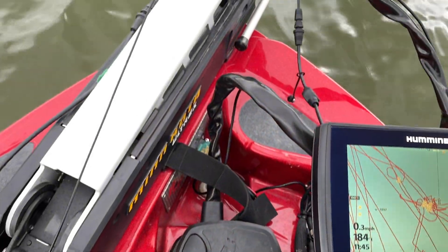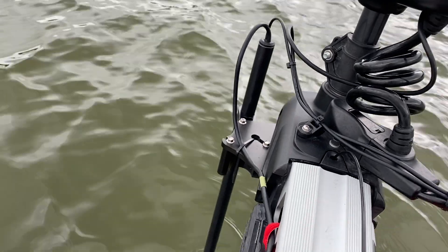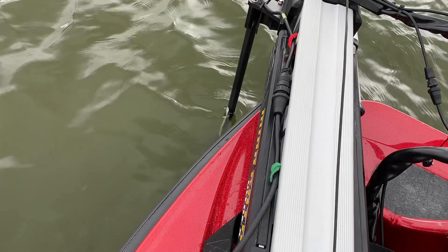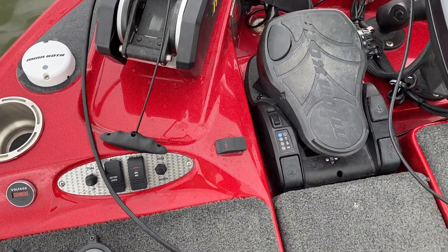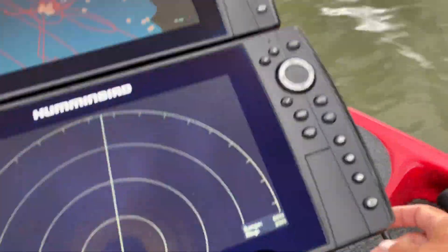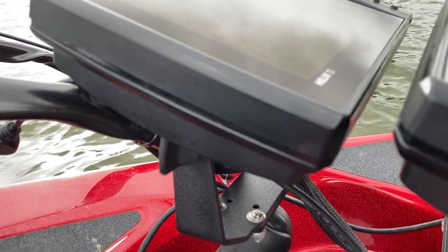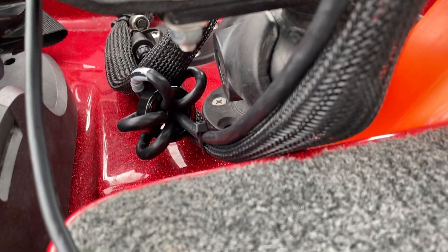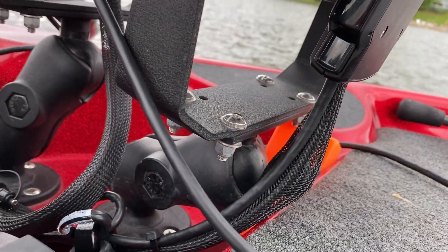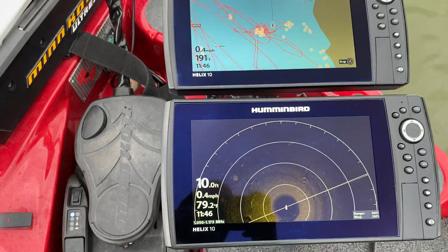Let me show you — obviously cables aren't run right. So I've got straight off of the Mega transducer, the transducer cable running down basically completely isolated away from anything to do with trolling motor power, running down the trolling motor bracket. Right now I just have this cable kind of freely out of the way. It comes back, wraps around, just so it's out of the way — not coiled up — and comes in right here. I've got the ferrite ring on here that you asked me to put on; unfortunately I can only get four wraps on there, so I'm not sure how much that's helping. Then it goes right into the connector — about eight inches away. I was expecting to be able to put more wraps on but couldn't due to the size of the connector.